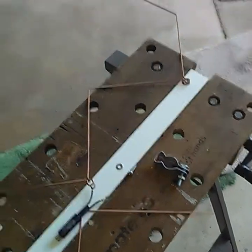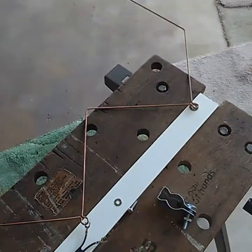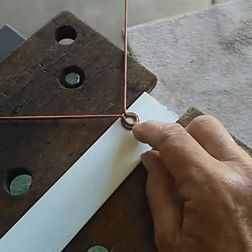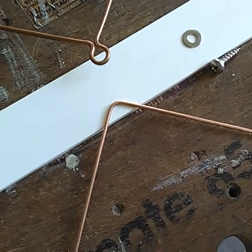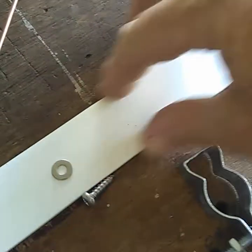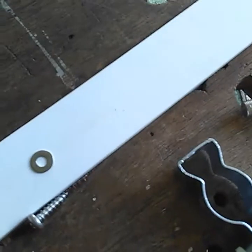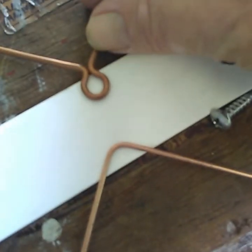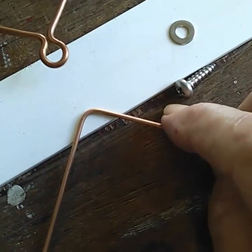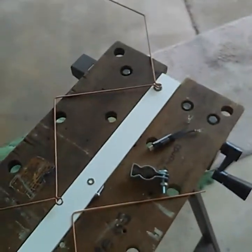This is just an alternative. You can take your finished bent Hoverman element — if you make secure bends with an eyelet, that's good, but right-angle bends are fine too. This piece is an inch and a half; two inches is better because you need space between your mounts where you attach your elements. You just need to come in about three-eighths of an inch and you can screw that down. That's a quick and easy method.